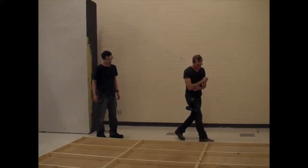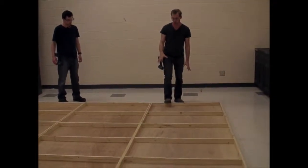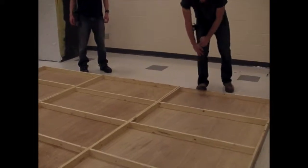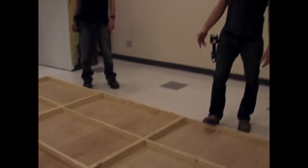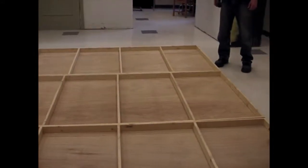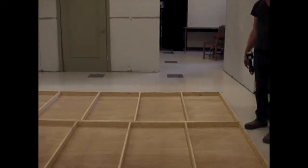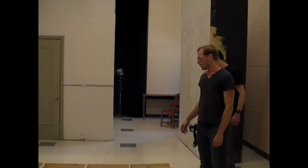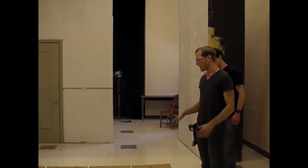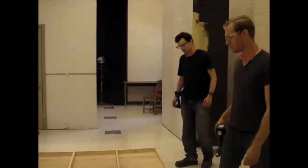Generally when you're working with flats, you've got your toggles. These ones are at about two-foot centers. The toggles are these parts right here. Ideally you want your flats to have toggles that all line up. It's not going to affect the stability of this wall that much that these ones are off center, but it's something that other carpenters on set are going to look at. If you have a flat that looks sloppy, it's not going to be great for your reputation.